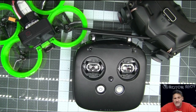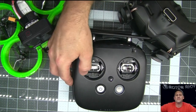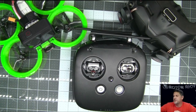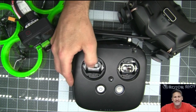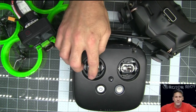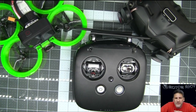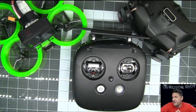I'm really enjoying that remote. Unfortunately it doesn't have metal gimbals, and it's not set up for DJI. So let's talk about the gimbals. These AG-01 gimbals from Radiomaster are all-metal CNC-milled gimbals — the nicest gimbals I've ever felt in all the transmitters I've used. They are very, very accurate and have that nice tactile click versus plastic, where if you push down hard you might end up overshooting the numbers in the software.